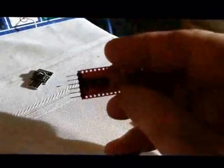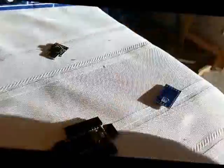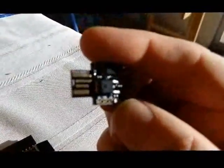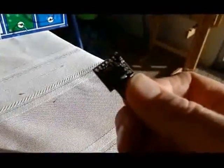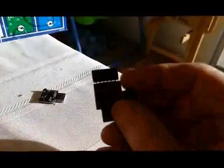This one does not have USB communications built in, so I have to use a USB adapter. This adapter plugs into the board, and then I can communicate with it and tell it what to do. When I want to make something, I just solder wires directly to the board, program it, and I'm all set. This other one is a Digispark ATtiny85 - I really like these. They plug directly into a USB port with no serial port issues, but they've only got about six input/outputs.